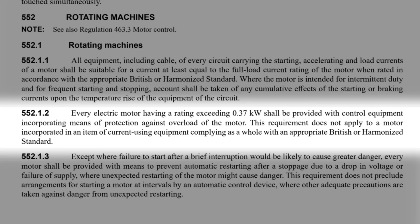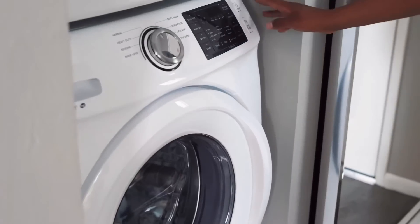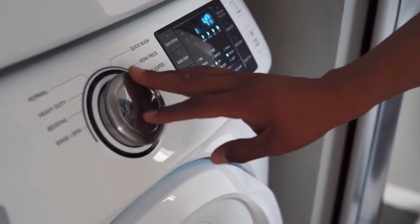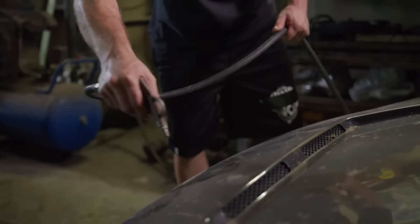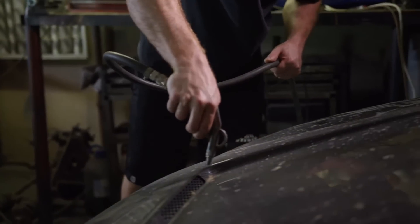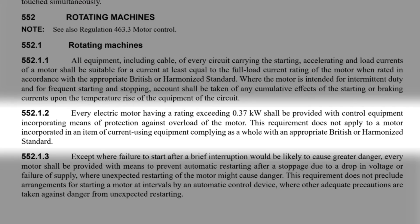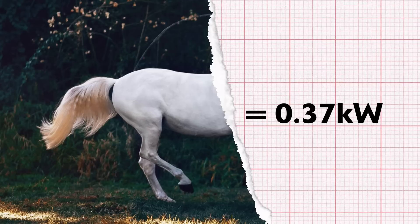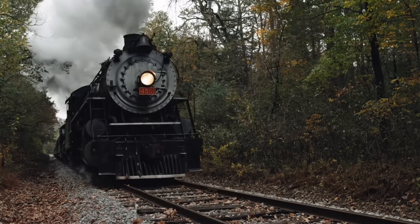That last sentence is basically saying that something like a washing machine with a motor in it isn't bound by this regulation, as the relevant British standard will cover all the requirements anyway. In an industrial setting, when using something like a compressor, the motor control and overload protection are usually incorporated within the equipment. Looking at the first sentence though, once a motor is above a certain power rating it needs to have localized overload protection. That figure of 0.37 kilowatts is the metric equivalent of half a horsepower — from the older non-SI system originally used to measure the output of steam engines and motors.